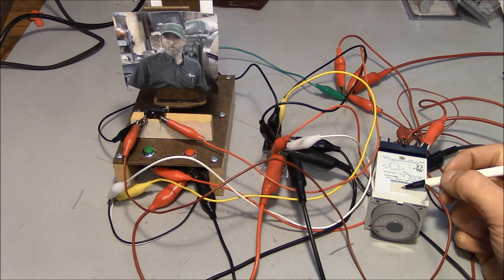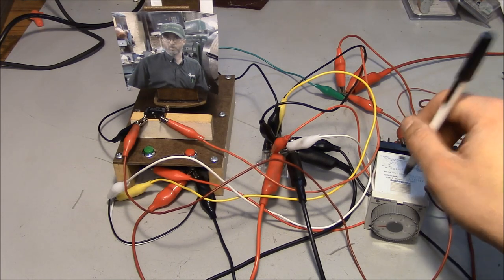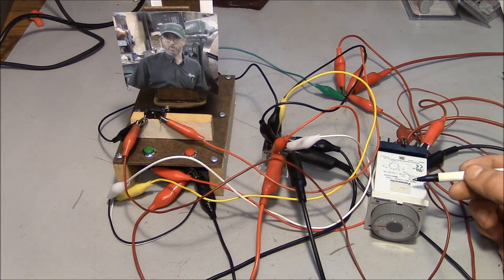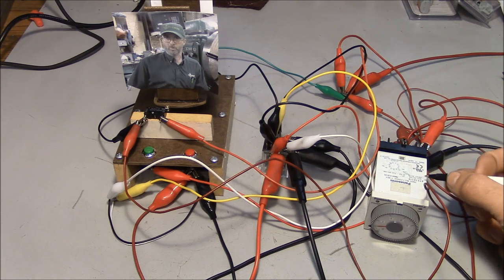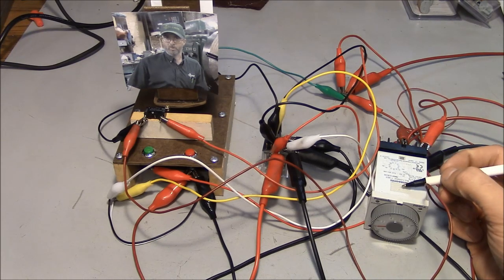And like I said, this is a digital, programmable timer relay. Everything inside of here is done with integrated circuits and ones and zeros. These things are extremely, extremely reliable. But they weren't always built this way. So before we had digital timer relays, we had mechanical timer relays. And I've worked on a lot of machines, older machines, that had mechanical timer relays that didn't work right. The problem is, inside of the actual relay, there's a mechanical clockwork mechanism.